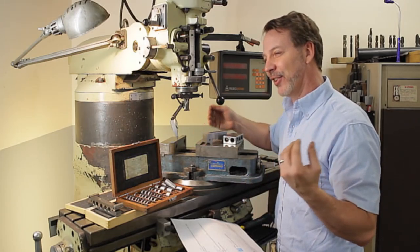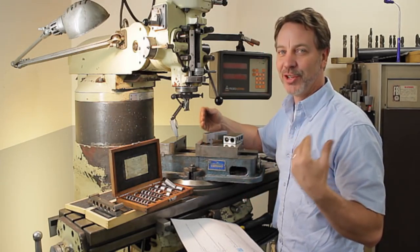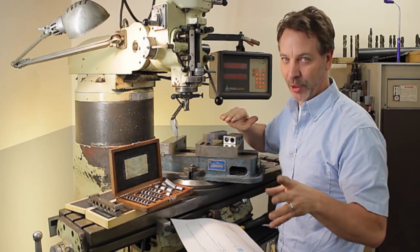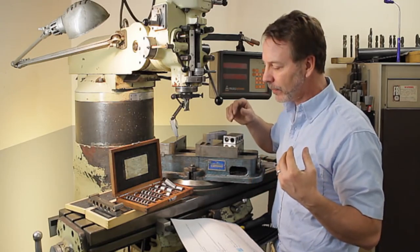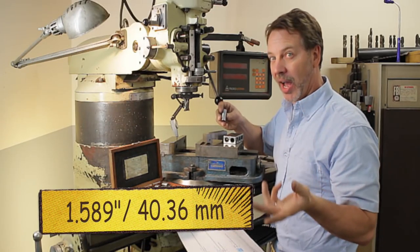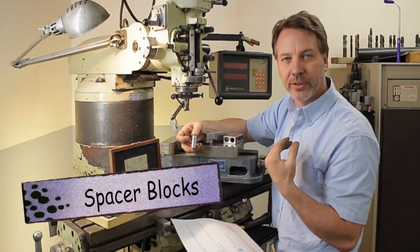I'm going to demonstrate what I've done here and set this vise to about 32 degrees. Outside Screwball asked a question — last time I set up to 30 degrees, he said, well if you make a cut, is it 30 degrees or is it 60 degrees? The answer is, it's confusing — it's yes and no. It matters how you put the part in there and what you want to do. I always suggest doing a test cut when cutting any angles, just to make sure your orientation is correct. So I hope that answers your question, Chuck — it's just confusing.